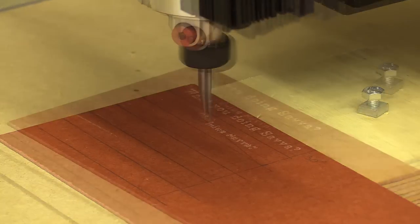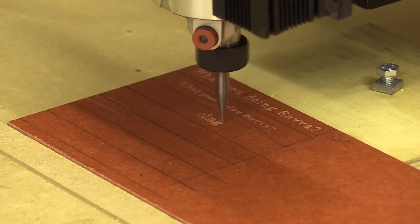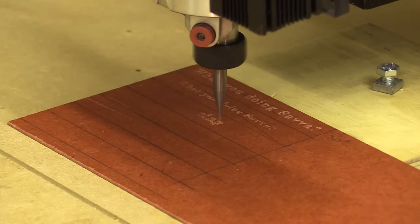What does that mean? The G-code was set to 30,000mm a minute in the file I exported, but was limited to 3,000mm a minute, which is still way too fast.